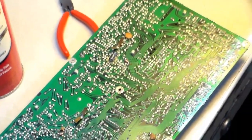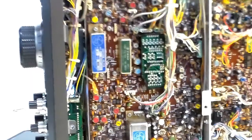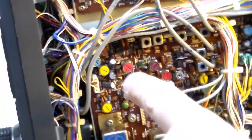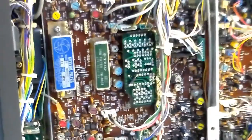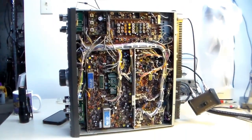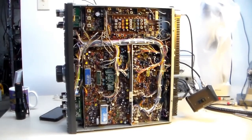Let me put a little bit of solder on here before I put it away. The connector's back in — we can wiggle it and nothing's going wrong. The resistor we replaced is up there somewhere. That takes care of the service update, and I guess we've got to put it back together and give it a test run. It still puts out full power, so once we get it back together we'll show you what it looks like buttoned up, and we'll go from there.